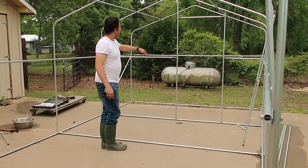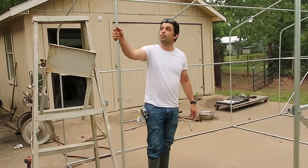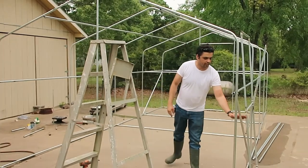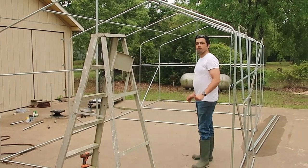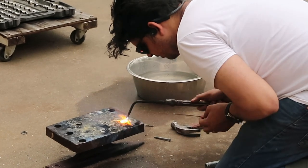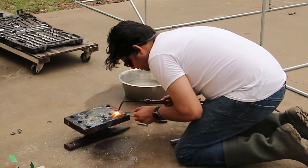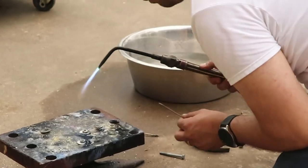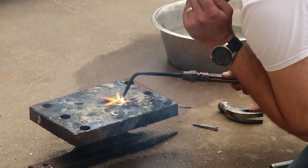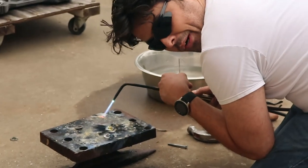This wall, like I just did here, putting in all these partitions, I'm going to duplicate the same thing on this exterior end. You can see I've already put in the vertical post. And then I'll put in some more diagonal braces like I did on the sides here. I'll put some for the end wall. I'll put a few diagonal braces in there to really stiffen it up. That popping you hear is because these washers have a little layer of chrome, and that chrome pops off.